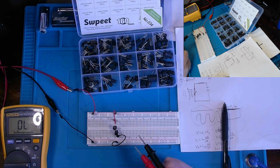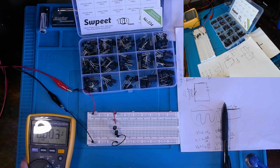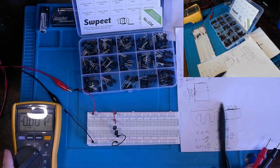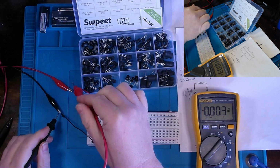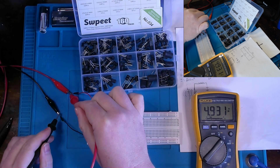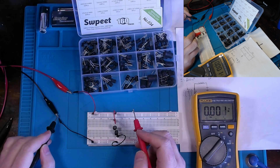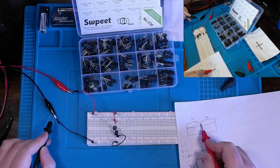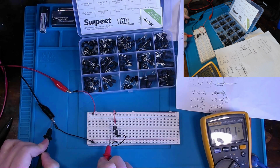So I'm going to turn on my power supply for a minute. I've got it set to 5 volts, and we're right about 400 milliamps in circuit. And I'm going to set my multimeter right here, and let me get this light out of the way for you for a second. It's causing my camera to go off, but we'll just take this from positive lead to negative lead here, and you should be able to see that 5 volts. Now it's under a load, so if I was to disconnect it, you'd see it jump closer to 5 volts. But if I go between here and then check in the middle of my circuit, i.e. right here, we can confirm that voltage has been dropped across the first inductor. So let's go here.